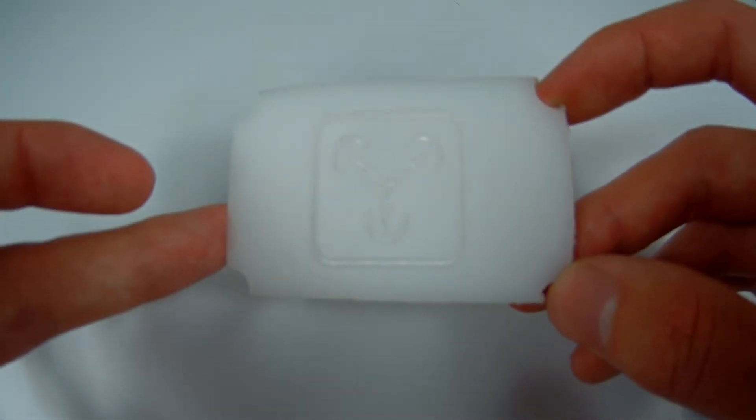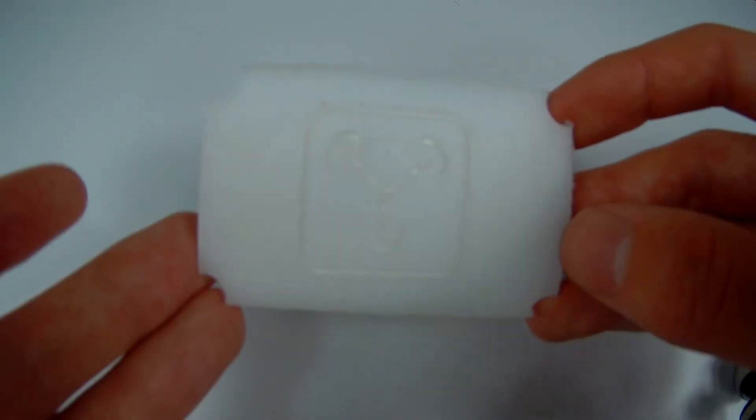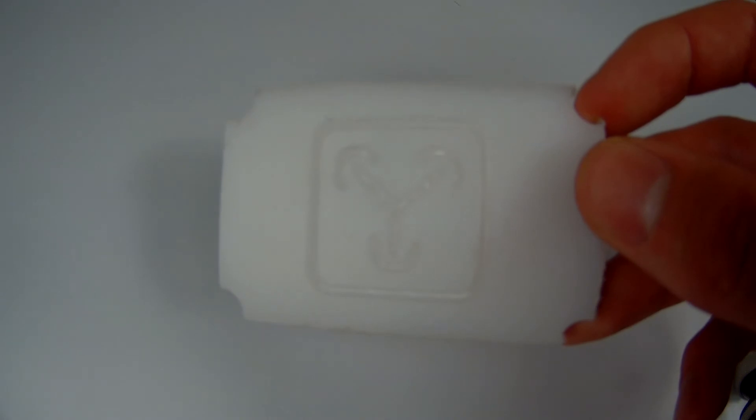Those speeds I set up right at the beginning — I'm not 100% sure about them. They might be okay but they might not be. This was going quite slowly and it took about 40 minutes to do this one small engraving, which seemed a little excessive. The machine was also giving me huge vibrations — I'm not sure if that was just the table it was sitting on or something else, but there might be something I need to do to tune the machine. So lots of stuff to look at. That's my brief overview of how I got this machine up and running and cutting things for the very first time. Hope that's been useful and I will see you in the next video.